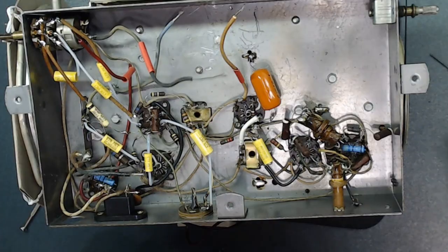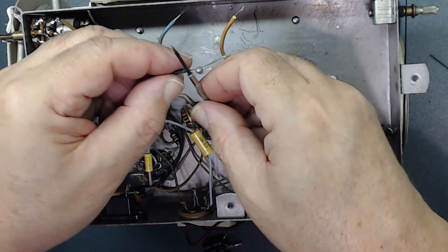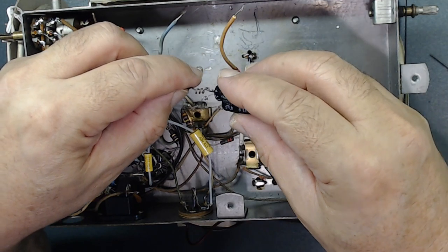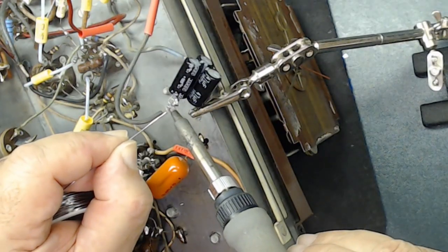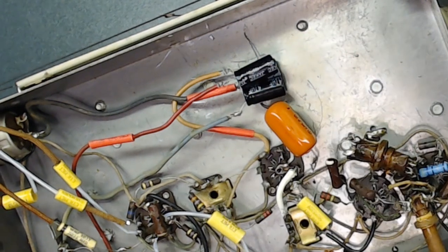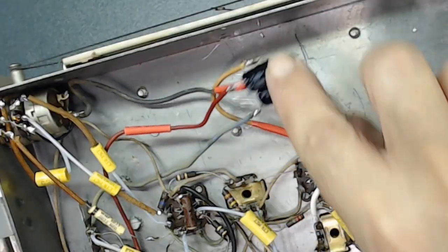This is the negative. I'm going to get my thicker screwdriver — the reason I use thick is it's about the same size as the center negative. I'm going to make a pigtail right here over the ground wire like that. Take the capacitor, start twisting it inside like that. Now I can solder this. I could put shrink tube right over this one. You see, I put the wires inside those pigtails. I already soldered one — I have two more to go. That is one done. All of them are finished, and as soon as they cool off I'm going to put the insulation over them.